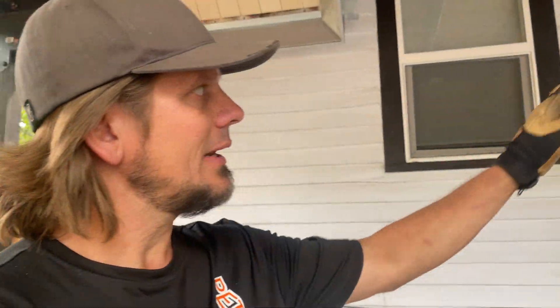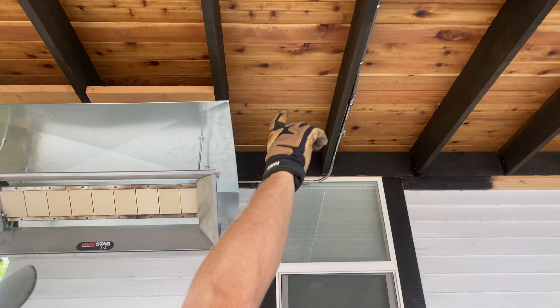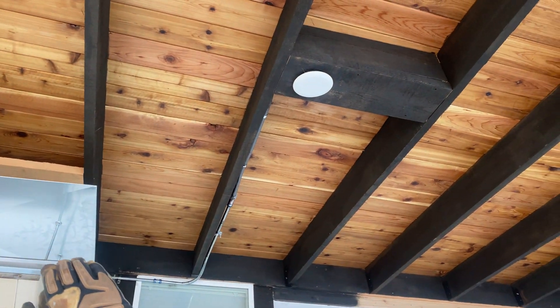You don't have to wire a pergola at all — it's not required by code. All you have to have is an outlet at the back door and one light or a motion light. But if you're going to do this work, you've got to live with the pipe. That's just what it is — you don't like it, paint it; you don't like it, don't do it.